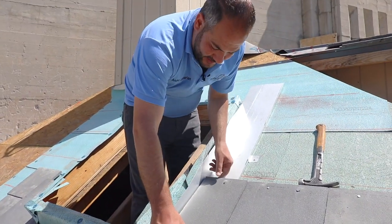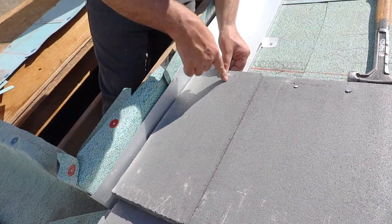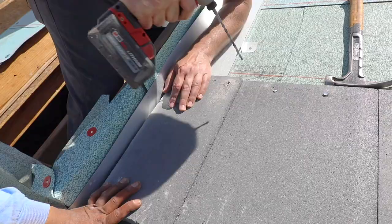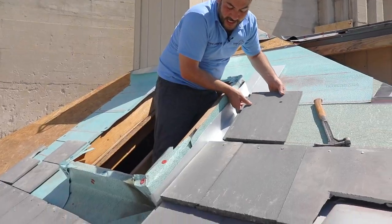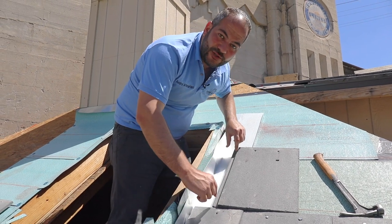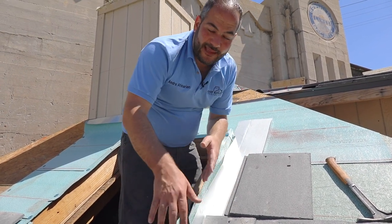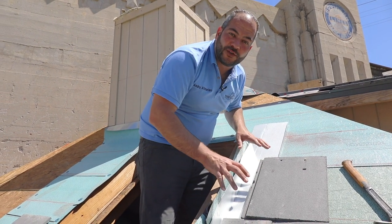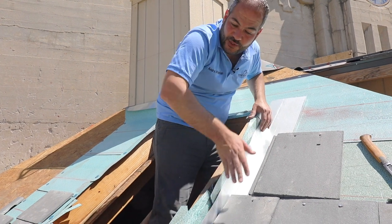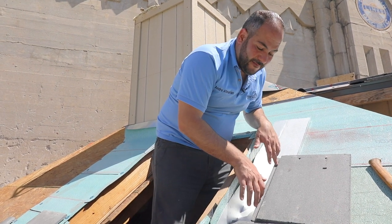You can see we've got this tile cut down to size. You don't need to be perfectly butted up against the curb — you can leave a quarter to half-inch gap. One thing we want to be sure of: we're not nailing through the tile pan ever. If you had a small strip of tile here, you still don't nail it down. What you want to do is cut that narrow strip down and glue it — whether caulking or mastic — glue it on this lip. It's a lot better for that tile to fall out, because really this tile is not doing anything as far as waterproofing goes. It's just aesthetics to cover up the tile pan. If we left the roof as-is, it would still not leak because all the water would get in here and travel off the roof. So don't make holes here — if you have small strips, use glue and adhesive to fasten them down instead of nails.